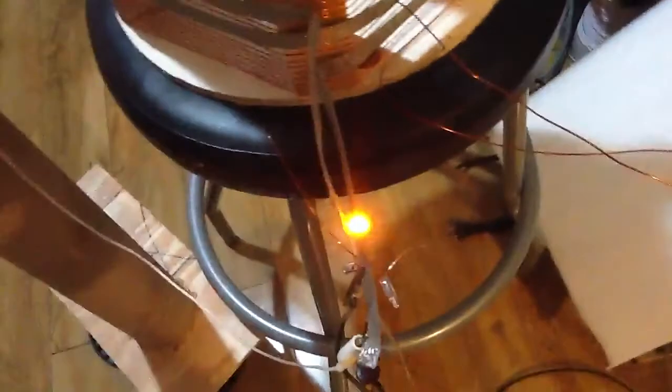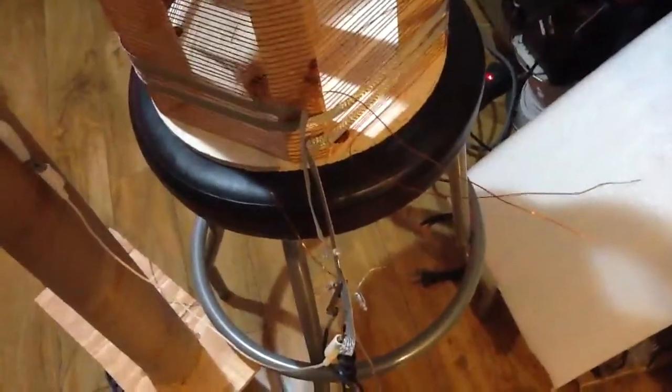Check this out — we've got light. I'll pull off this one extra can. Pulled that off. No light. Put it back up. The light's back. So adding that one can to the top for just a bit more capacitance was able to bring it into a nice range. There's even a point where it can be too close to this plate. It doesn't just get brighter and brighter — there's an actual point where it's too much and too little. Pull it back away. Bring it up close. Too close.